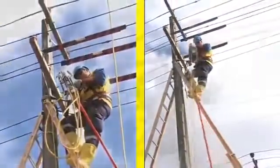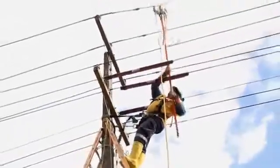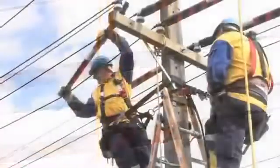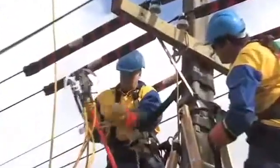Earth should be fitted to either side of their work position as per the SMEI handbooks. Where there's a multi-pole shutdown, there must be earths within 5 metres of the work position. Electrics is moving to the K2 range of earths, as these are easy to apply and store. They also create less of a hazard aloft by using the conductor as a common point, instead of the usual star configuration of traditional earthing sets. Another added advantage is that they don't have long handles that are prone to damage.